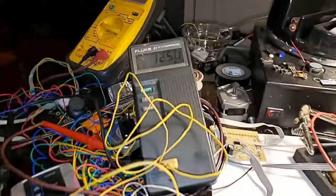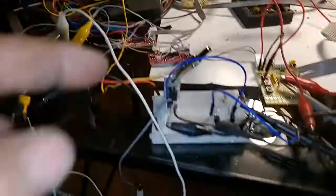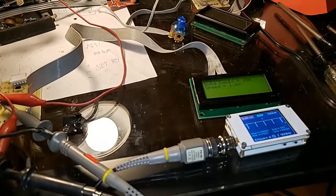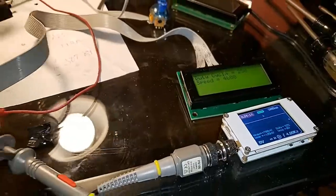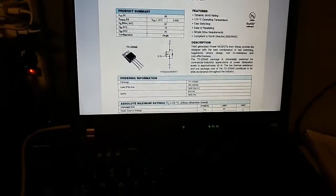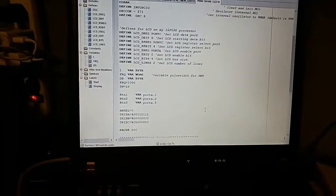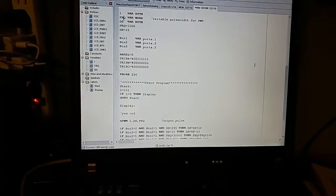I've got that pretty stable at about 125, keeping up just a little bit. There is a certain point where it could let the smoke out of that thing. I can also experiment with different frequencies — looks like 4,000 Hertz is a pretty common switching speed for AC motors. I'll let that run. It's a simple program — got the LCD programmed good, and my variables for buttons one, two, and three as my inputs, frequency and duty cycle variables.